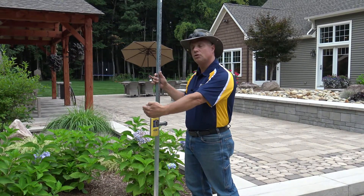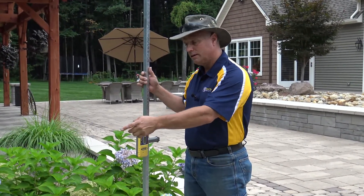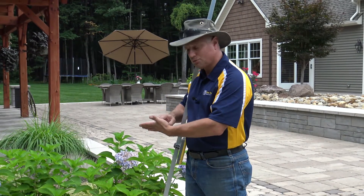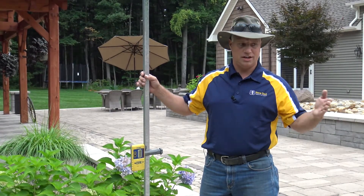From that point of my patio, say I'm going down 3 six-inch steps — that's another 18 inches. So 18 plus the minus 3 is minus 21. I write that on my plan — I can do all this in the office. Minus 21 at the bottom of those stairs.